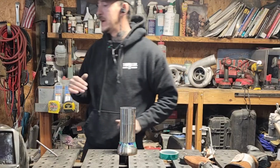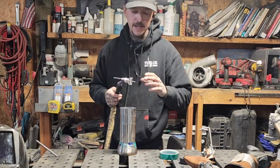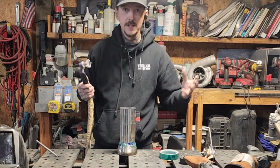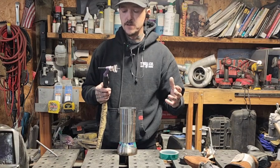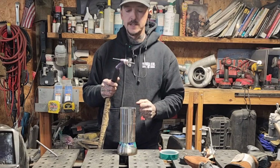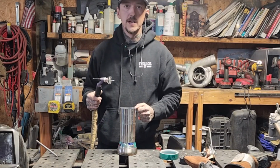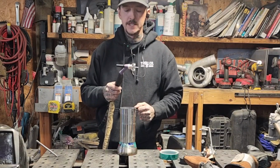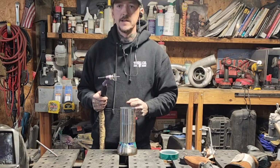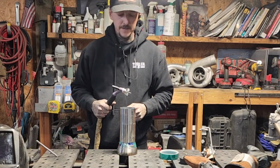And what I like about our EDGE cups is, we're talking about shielding the back side of the weld right now, right? Well, the front side of the weld is obviously just as important, just as critical. And with the flow out of their cups, it's top notch. I mean, you can guarantee you're going to get enough coverage. This GL18, I really like the 18 for stainless, and you can go way up from there. But this is kind of my go-to lately for stainless.